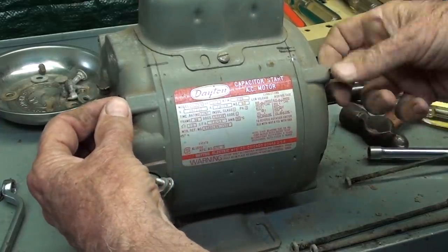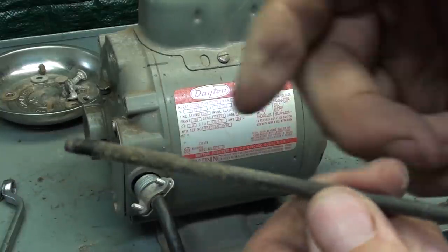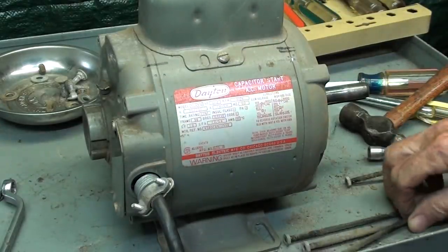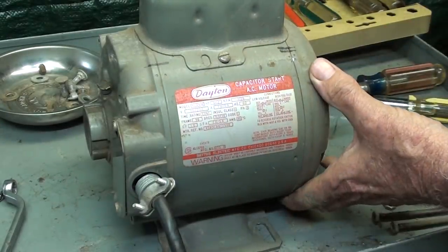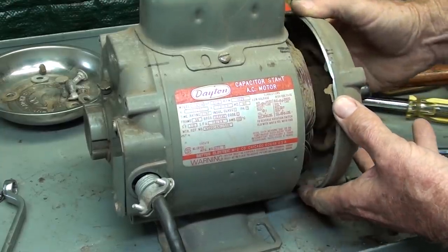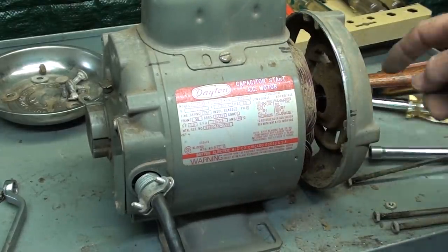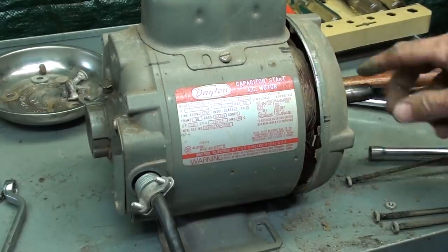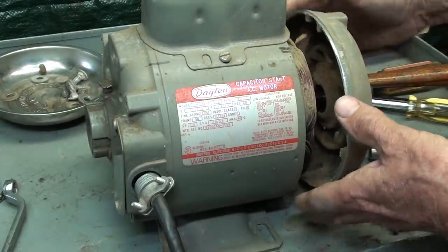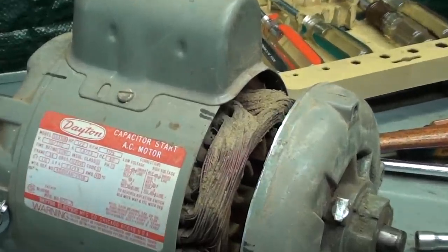All right, three down, one to go. And take a look, maybe it doesn't show up, but look at the dust and debris that is on that screw that went through the motor frame. So now, will these come right off? And does. Now I'm going to polish the shaft just a little more. I did run some emery cloth over it, but there's just a little bit of a burr there so that this end bell comes off. But already look at the dust in there.